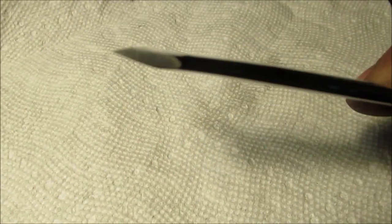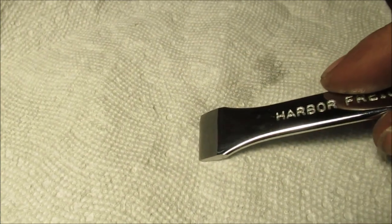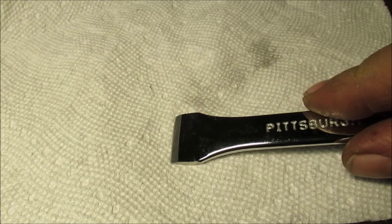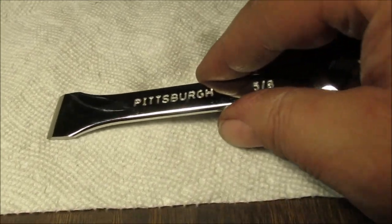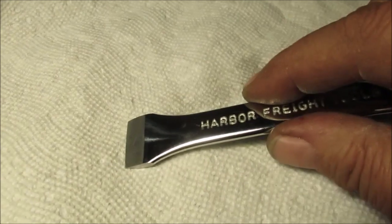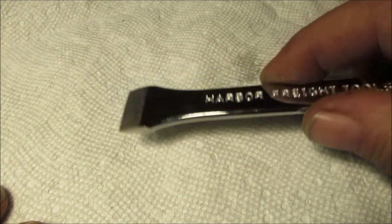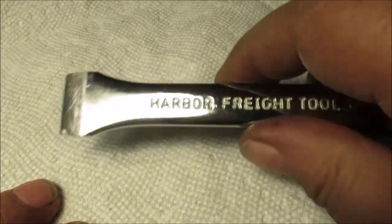Okay, this ain't knife sharp. You don't really want it knife sharp. But this is like, I like it. Okay? See, that's a short edge, that's a long edge. When I get on a gasket, I want it to be about like that. Now you can go like this down here, lower. See how close you are to what you're working on. You might be on an engine block or the head of an engine. So I like to be like that. Even on a lawnmower, well, be careful on aluminum blocks. You'll carve it up so bad. This way, when you're going, the gasket slides over that thin edge. You can get underneath that gasket, okay? But it's your preference. Make it the way you want.